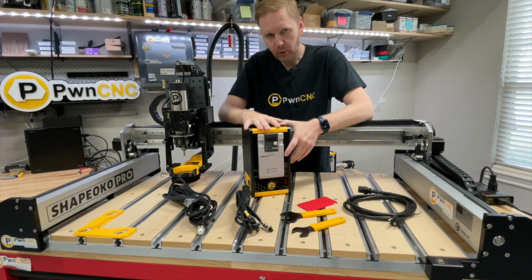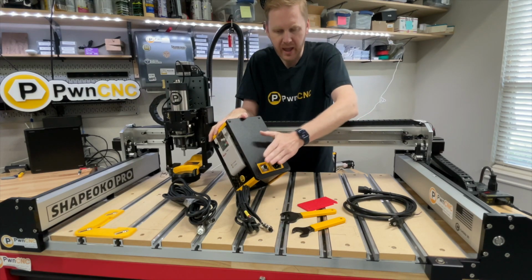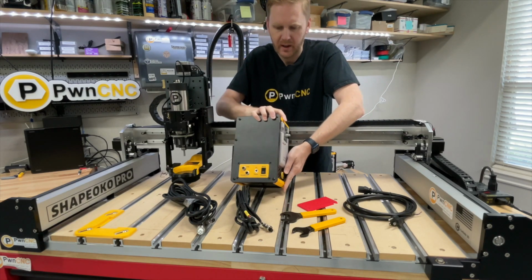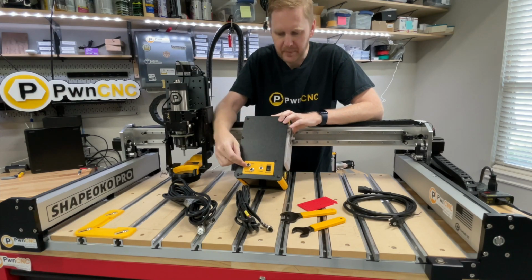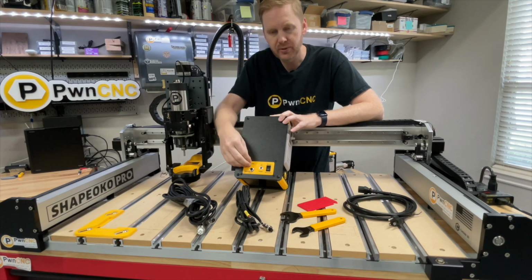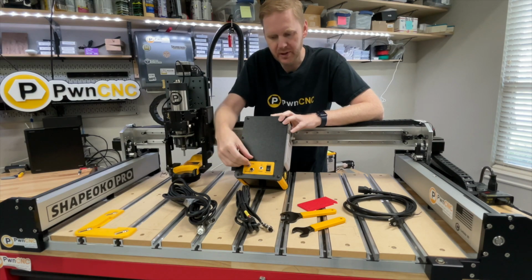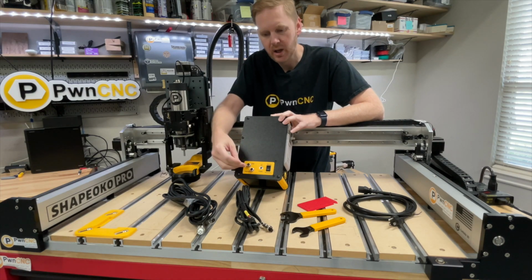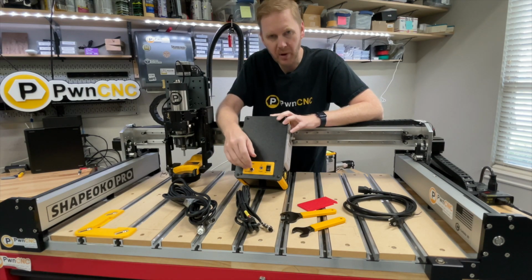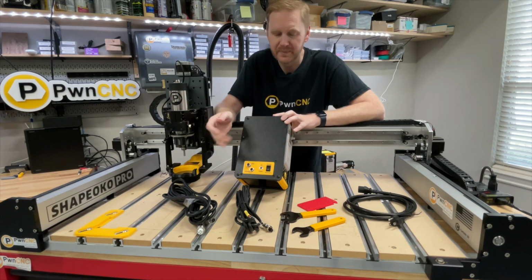On our version 4 enclosure, you will find the plug-and-play power and spindle cable, as well as the PWM signal, which has forward triggers, PWM, ground, that sort of thing. We can talk about that in a minute. We also have a Modbus control, so these are both control ports. One is for Modbus, which is typically Onefinity's older black box controller, or a Buildbotics controller. In this case, PWM is pretty much for everybody else.